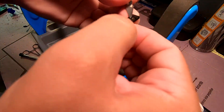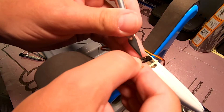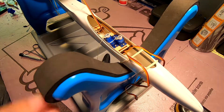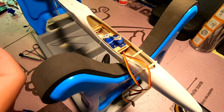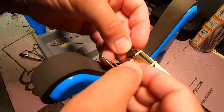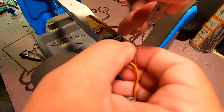Do not try to just pull this connector through between the two forward servos — you'll just get it locked in place and then you're not going to be able to reach in there and get it out. So do not skip this step. And if you tear up the connector doing what I'm doing right here, you can always get another connector. With that off, out it comes. Then you can reinsert connectors — make sure you have them facing upwards, and to get them fully in, just take the tip of your exacto knife and push it into place.